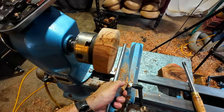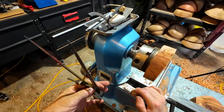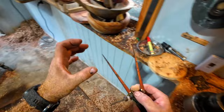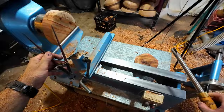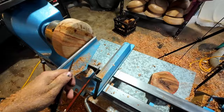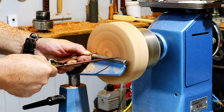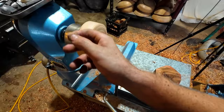I've already measured up for my recess. We're going to use the shark jaws — I've gone to the outside and kept them slightly open, so it won't be a fully closed circle and I've got some wriggle room when I come back to mess around with it. I'm going to take the majority of the bulk from the top side, bring this up to centre height and mark it. Left side touches, right side shutters — as we all know.